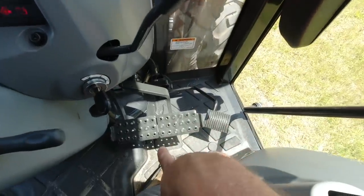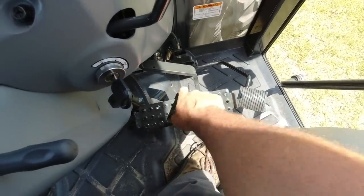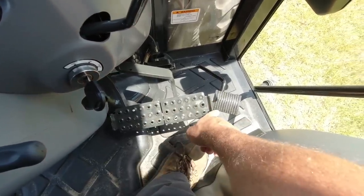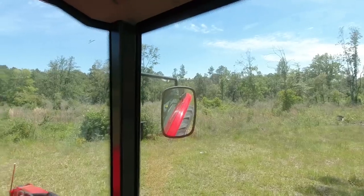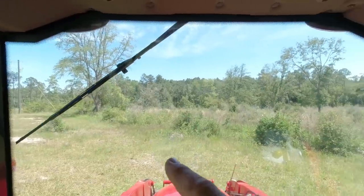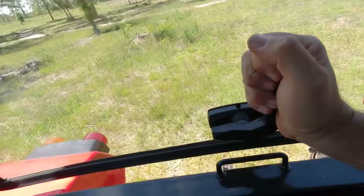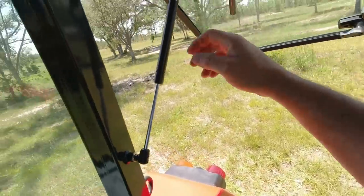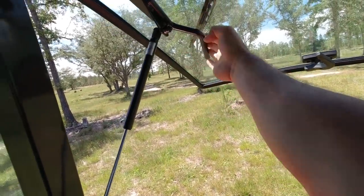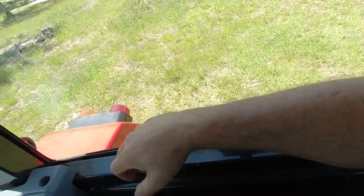Here's your throttle. You do have independent brakes — move this lever and now your steering brakes work left and right independently; flip that lever back down and they work in concert with each other. And there's the foot throttle. You're going to have two mirrors for your rear view, a windshield wiper in the front and one in the back. The back window opens with this handle here for a nice breeze, and you close and secure it with a handle on the other side.